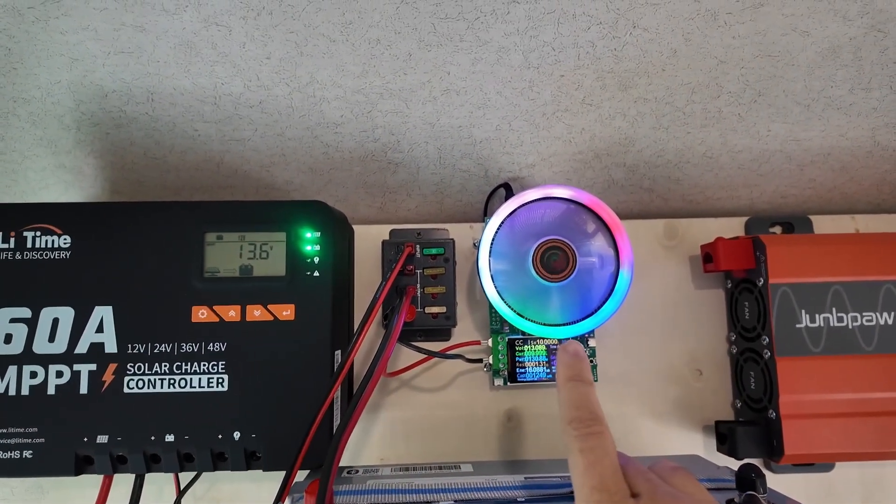This is a very good tool. I don't need to necessarily drain my house batteries to prove that a solar charge controller works, and I don't need to stop charging my house batteries by recabling just to do battery testing. I can test USB power packs, smaller 5 amp hour batteries, 10, 12, 20 amp hour batteries. And then these big boys — I've tested up to 300 amp hour batteries on this. It takes a long time at 10 amps to pull power out of a 300 amp hour battery, but it does it. The old one that I had was perfectly safe — it was me. I tried to pull way too many amps out of it, and that's why it busted.